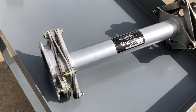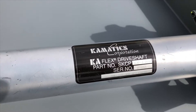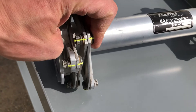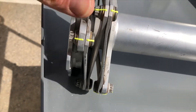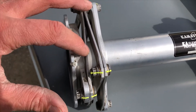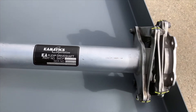One way that tail boom flex and misalignment can be adjusted for is this K-flex drive shaft. The drive shaft connects to the input, and you can see it can take a little bit of flex. They're hooking things up 180 degrees apart — one flex portion connects here, another flex portion attaches at that point. This is called a K-flex coupling.